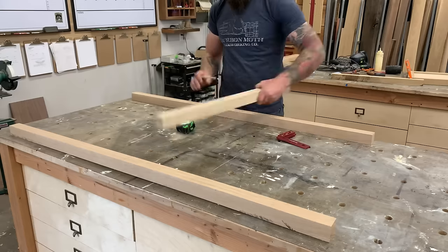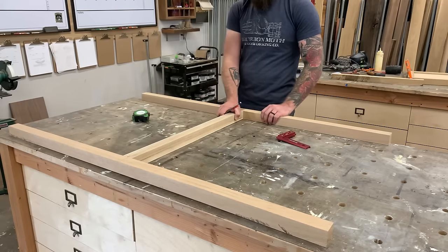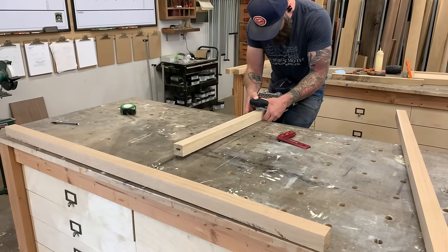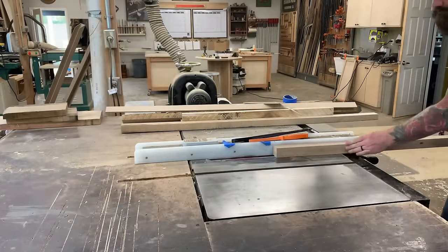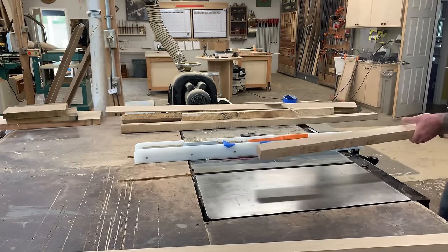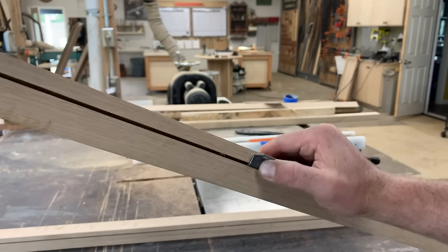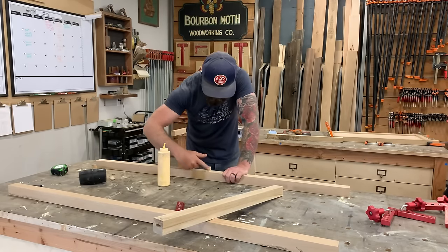With our two side pieces in clamps I jump over and start working on the face frame portion of the cabinet, as well as the back two support pieces that make up the entire cabinet box. Again hooking everything together with the Domino joiner. The face frame is simple — just four cabinet doors, so three pieces total. Before hooking it all together I run the top face frame piece and the top back support piece through the table saw, cutting an eighth-inch groove to hold the z-clip fasteners that will secure the cabinet top.